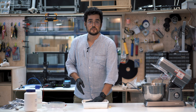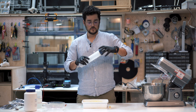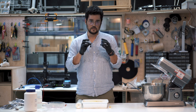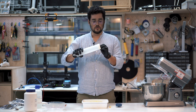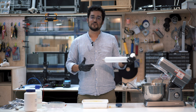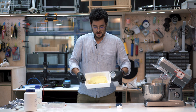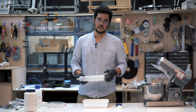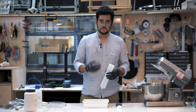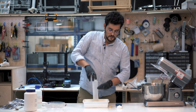Let's start filling up the cartridge. We have two caps: one end connects to the extruder system — the blue cap that we can unscrew. Watch out because on the inner part there is an O-ring or rubber ring; it's important not to lose this because it helps create the seal for air pressure. We don't want to fill it by hand because that creates a lot of air gaps and air pockets inside the mixture, which will also cause extrusion inconsistencies. So we flatten the mixture nicely and push it firmly until we reach the end of the pocket.